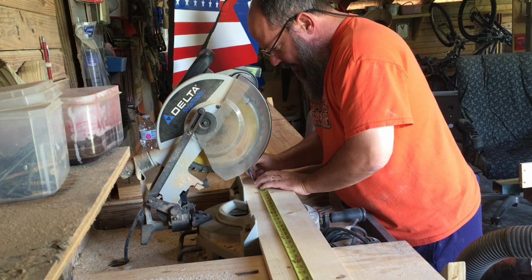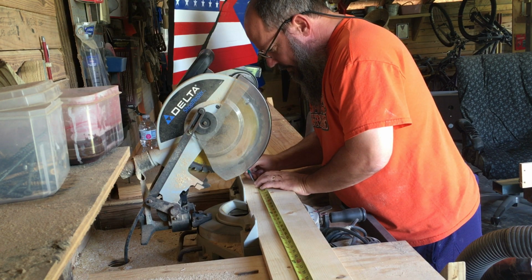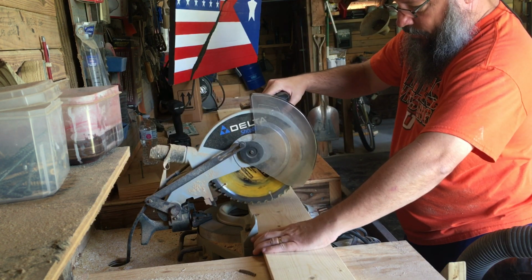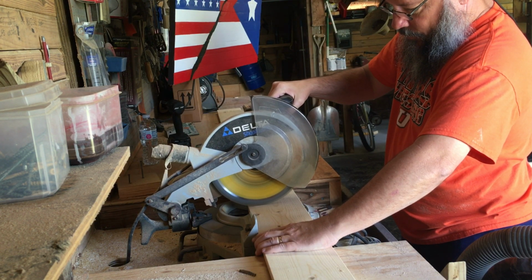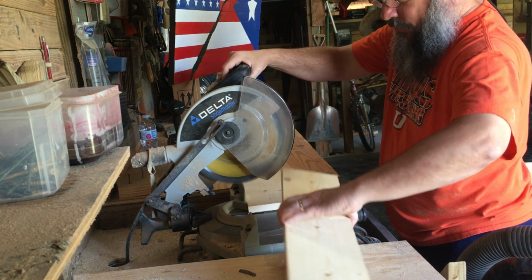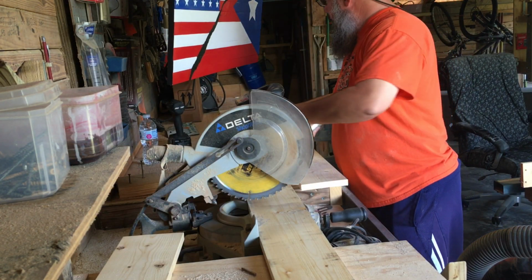And this week I will be making a 4-tier blanket ladder. And what you see me doing there is measuring up the side rails. I believe I went with about 6 foot long on the side rails, which is what's going to determine how tall it is.